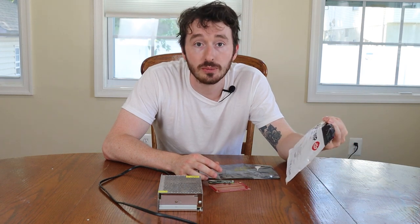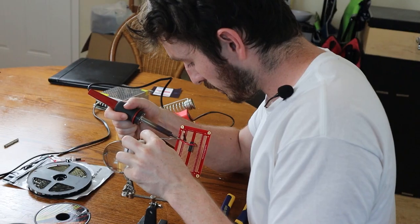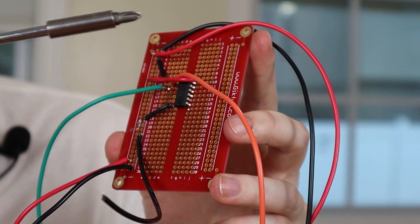It's time to start programming this thing to put words on the screen. Truthfully, it's going to be difficult if you're not a programmer or tech-savvy to set this up. I'm using a Raspberry Pi Zero to control the LED strips. The LED strips I'm using are the WS2812B model — that just means that each LED is individually programmable, which you'll need for this use case. We need a power supply to power the strip, and I need to create a circuit to send information from the Raspberry Pi to the strips correctly. So the first thing I did was start soldering up the circuit. This is needed to make sure that the signal coming from the Raspberry Pi has a proper voltage going to the LED strip.